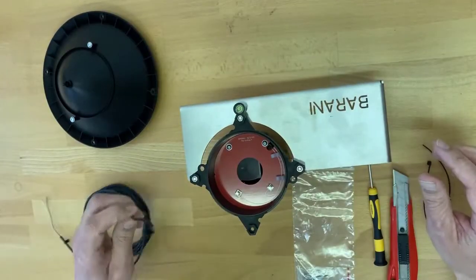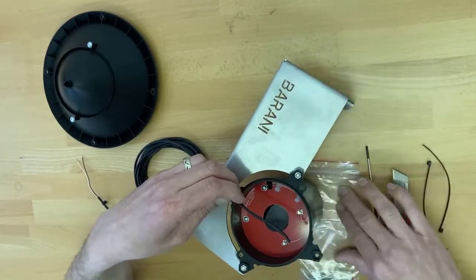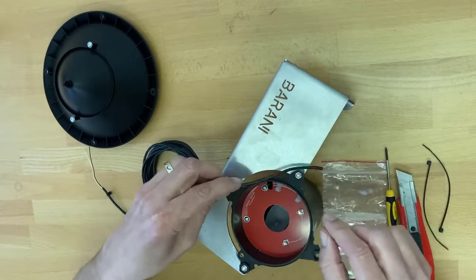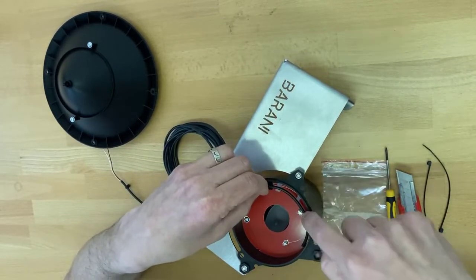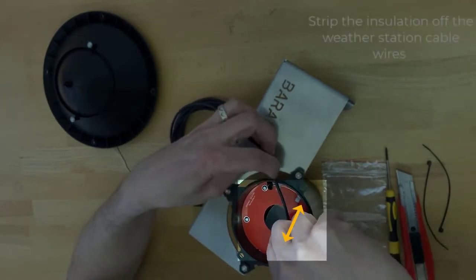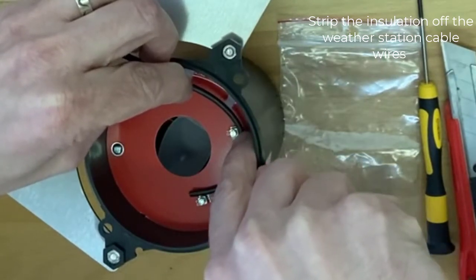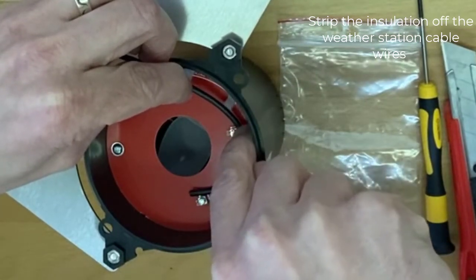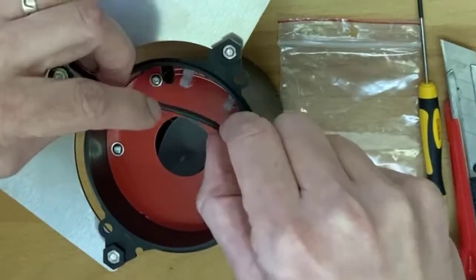Let's connect the wires. First, take the wire and place it close to the wire terminals to judge the length you'll need. I recommend stripping the wire from the furthest terminal to about a quarter inch or one centimeter away from the first plastic cable holder.